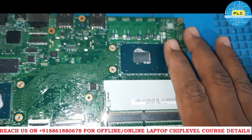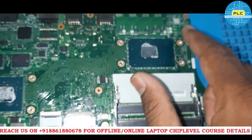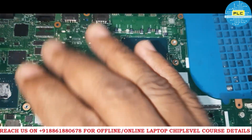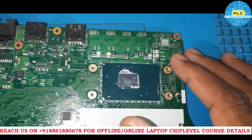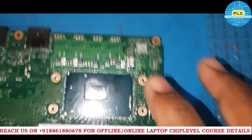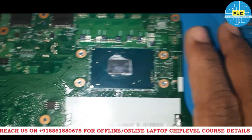Once again I will repeat: first we remove the appropriate capacitors — after that, same beep. Then we completely check at the IC level, find where the fault has gone, remove and check those ICs. Here also the core IC I removed and checked, but still I was getting the beep.